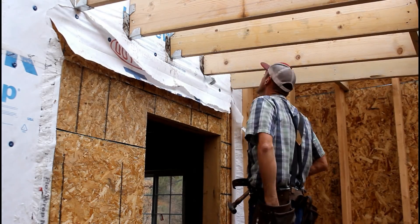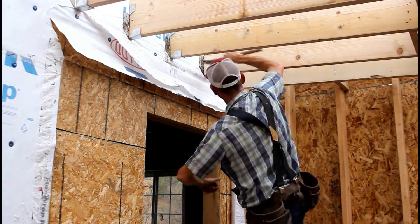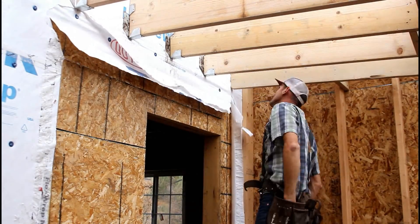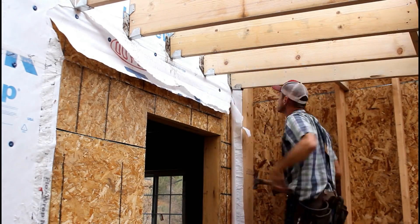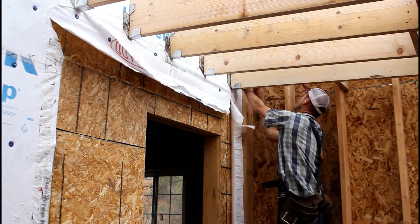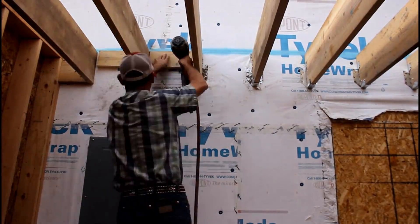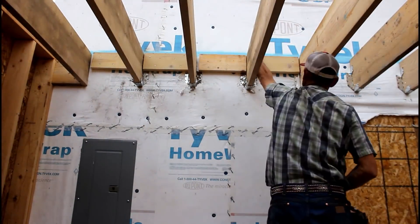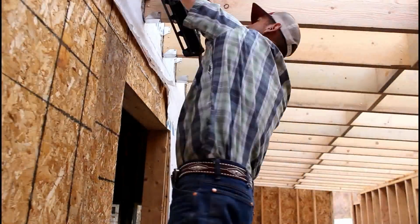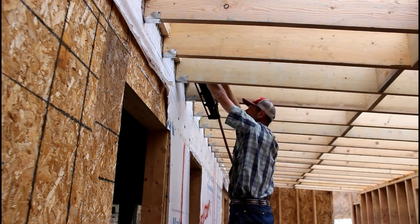By code I must build this house to at least an 80 pound snow load. In town, 8 miles from here, it's a 60 pound snow load. I could have put the original roof trusses at 20 inches on center, but the one thing I didn't want to do was under-build this house. I've done everything at 16 inches on center — even my floor joists are 12 inches on center.